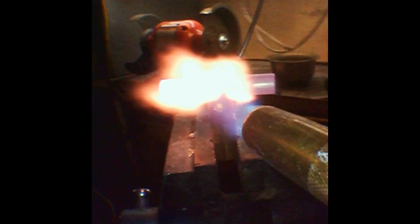At this point I want to secure this left and right brass piece before I drill it for the back rod. I want to make sure this is all held together firmly. Heating it up with 3700-degree MAPP gas — I had applied some flux. Because this is brass, the heat wants to flow through the entire part, so it takes longer to get up to temperature. Applying 1200-degree 56% silver braze, just making sure that's all connected. Dip it in some water — take a look at that fire scale.